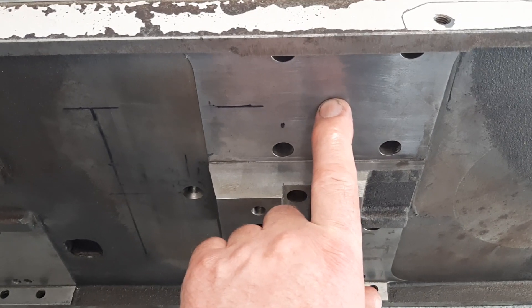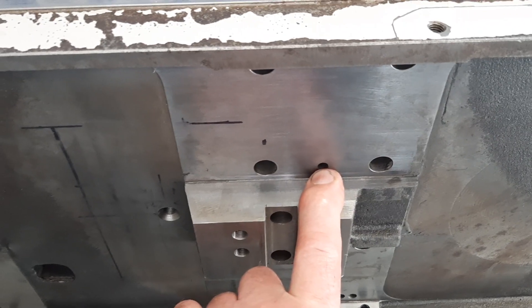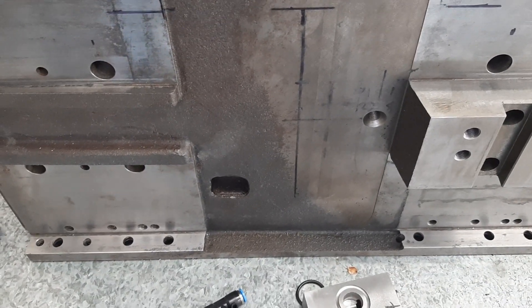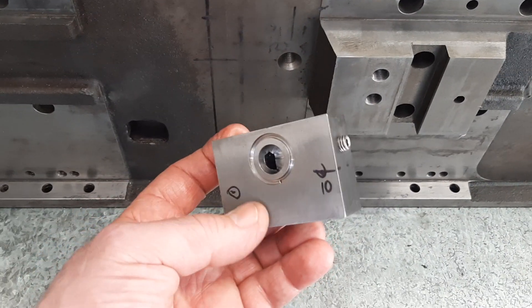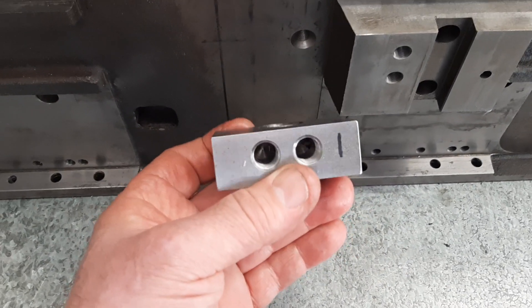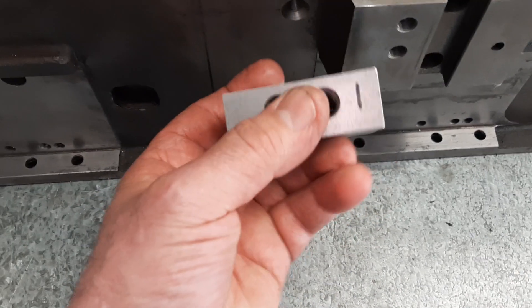The actual linear blocks bolt on underneath here. Normally you have the oil feeding in from the top, so these port into the NSK blocks which was on here, and you have the lube system feeding into each block. Now obviously I've changed over to the Hiwins. So I've made up this manifold here to be able to lube those linear slides. It's just a pretty standard piece of material, like an RLA sort of air manifold you might see. You can see where it's been cross drilled - I've drilled down and drilled across so it's feeding both of these ports.